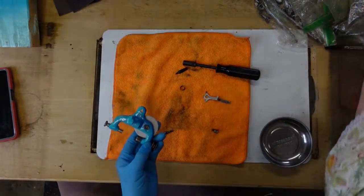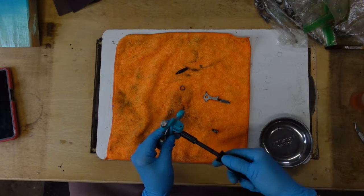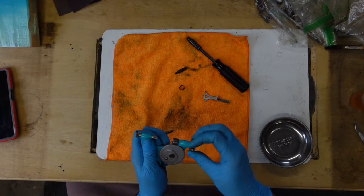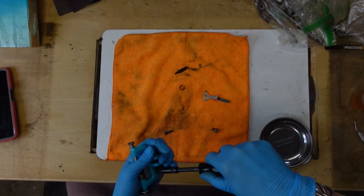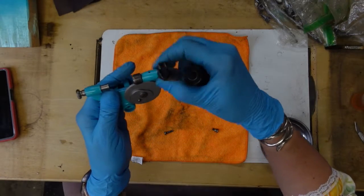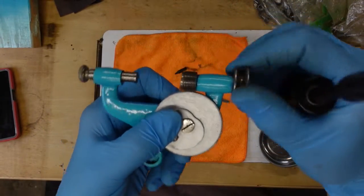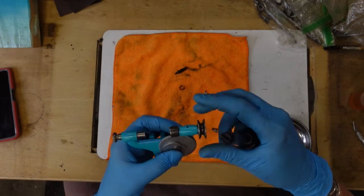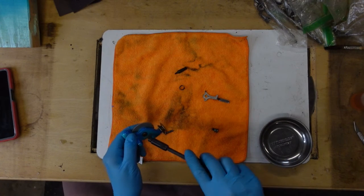Now that is pretty snug. Let me loosen it up just one here. When I loosen it up I can drop it — I don't want it to be binding in there. I want it to be close enough that those little teeth can intertwine and move easy, but sometimes when I get it too tight it just binds in and slows everything down. So I'm trying to find that happy medium point and tighten it at that point.